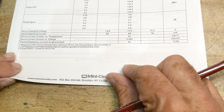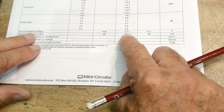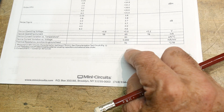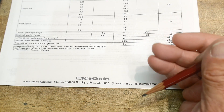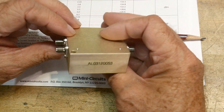It is a 5-volt part, which is really handy. So we'll have a 5-volt, 20 dB gain, +20 dBm nice little amplifier — should be very handy. I will design it to go inside this box.